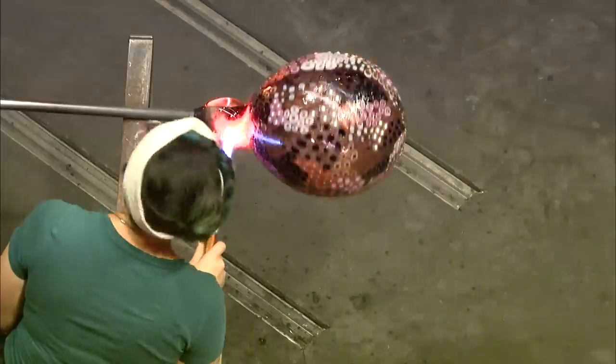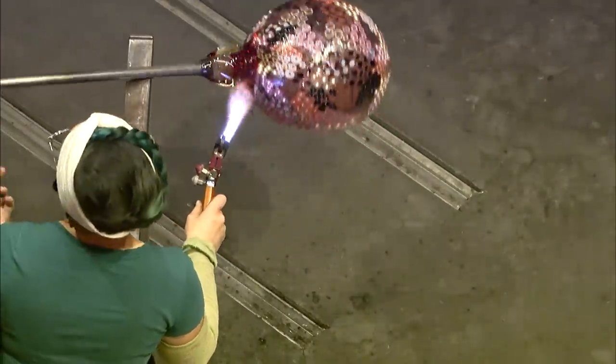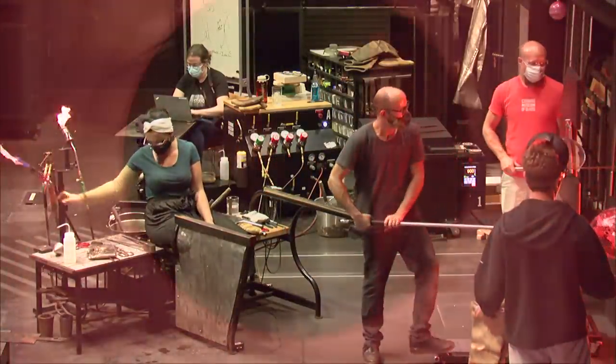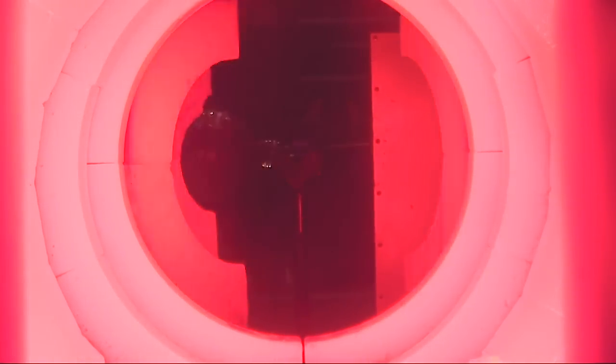We don't want to leave this outside of any of these properly heated environments or else it will crack immediately, because it can't handle that drastic of temperature drops that quickly. So that kiln over there has been sitting at about 910 all day, and then we'll run it through that proper cycle to bring it down to the correct temperature over those courses of hours.